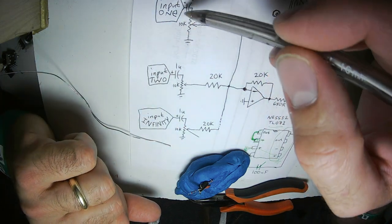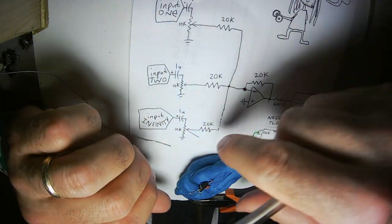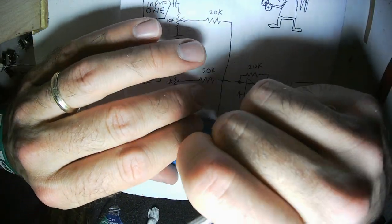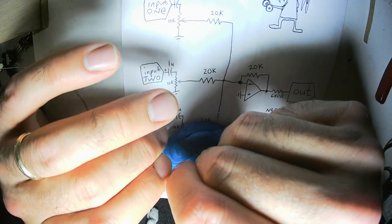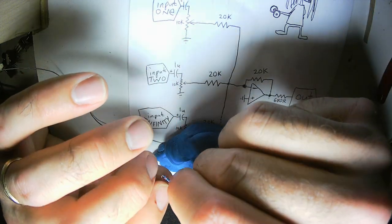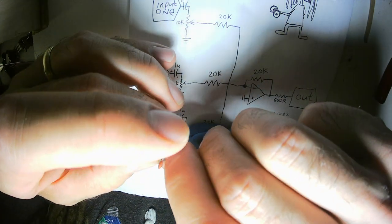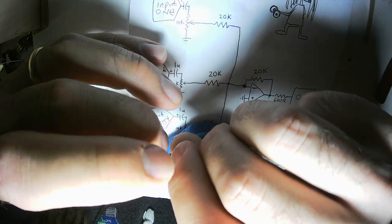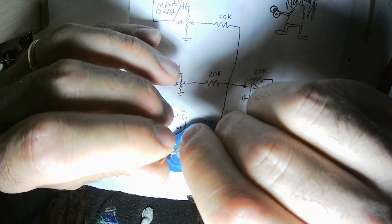The high-pass filter here is going to block DC. Most control voltages, some control voltages are alternating. Those will get through, like if you do an FM or something, frequency modulation, or vibrato, stuff like that.